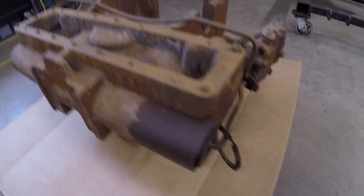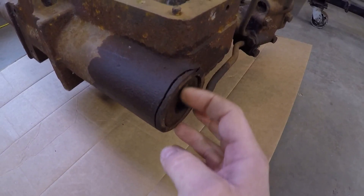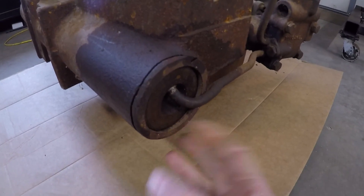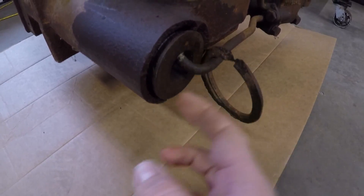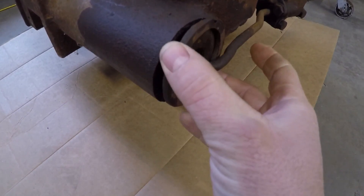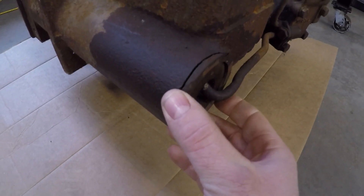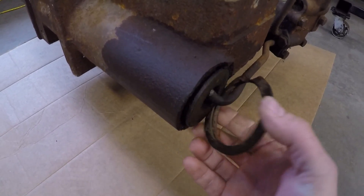We're going to have to do some rather extensive repairs to this casting too, because the end piece here that holds this plug in for the power steering piston has cracked out around the snap ring groove that's meant to hold this plug in place. I'm not really sure how we're going to fix this yet, but we're kind of looking ahead to try and get this resolved and get some kind of a plan in place.